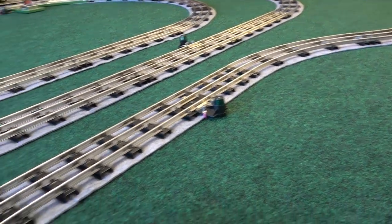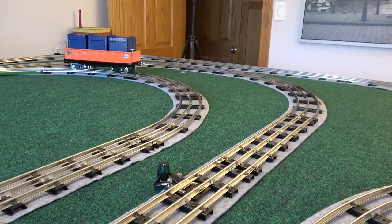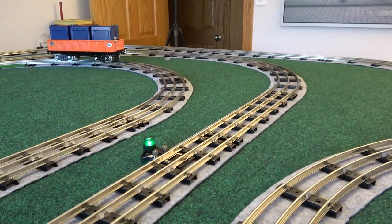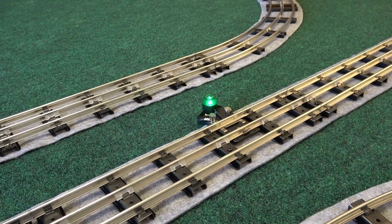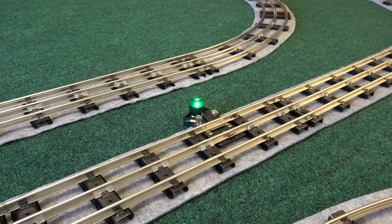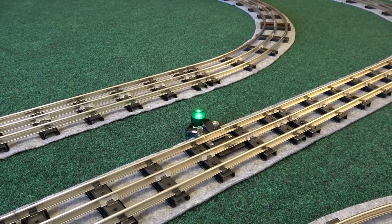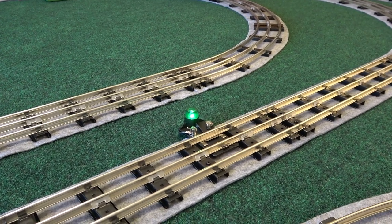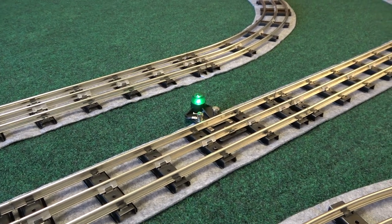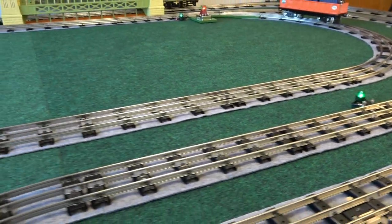Okay, but the rest of the TIU is still active. So if I look at this other lock-on right here and I flip the second switch to command, it still comes on because the TIU didn't die, because I have that auxiliary power supply going into the TIU, I should say, right? So even though fixed one is now at 0 volts, I'm still supplying the TIU with power, which means I can still use the outputs and everything else still works on the other loop.